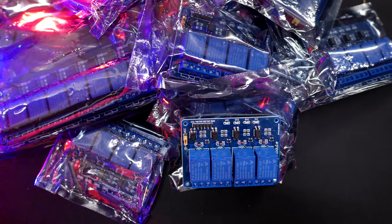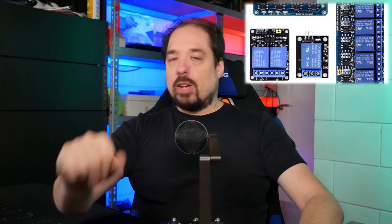After looking at all the available types on AliExpress, eBay, and Amazon, I selected a few types and bought a bunch of 4x and 8x relay boards. The reason for these boards specifically is that they have 5V trigger relays, but the optocouplers can switch at anything above 2.5V and require very little power doing so. That means they work great with the 3.3V GPIO pins of the ESP32, and since my favorite ESP32 development boards require 5V, I only need one 5V power supply for both. I'll have affiliate links in the description to these relay boards and the ESP32 modules I like to use.